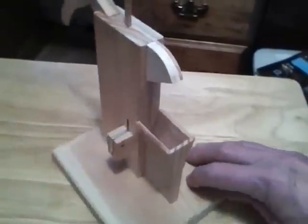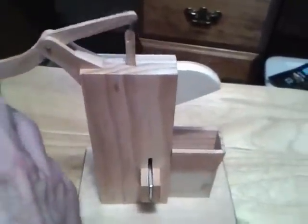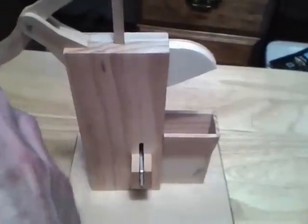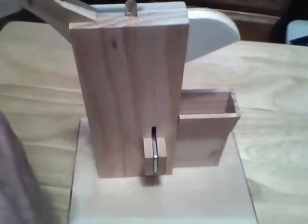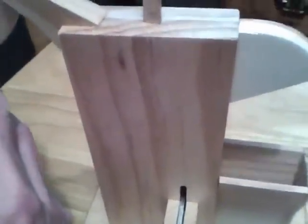You can see it's got a little crank arm here. There's a little slider that goes down through the pump — it's got a hook on the bottom that pulls the nickels up. There's a little check pawl there that, after the nickel slides in, holds the nickels in check. This device holds five nickels and will continuously pump them through.